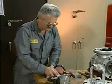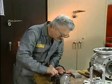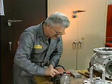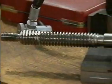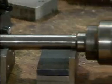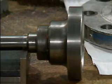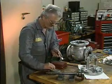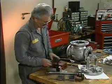The mechanic inspects the valve stem next for wear and damage. He starts by cleaning the stem with a fine emery or crocus cloth to remove dirt, chemical buildup, and burrs. Even properly adjusted packing can leak if the valve stem is bent or worn. A bent or worn stem can prevent the packing from sealing properly and make the valve hard to open or close. With the stem on V-blocks, the mechanic checks its straightness by using a dial indicator to perform a run-out